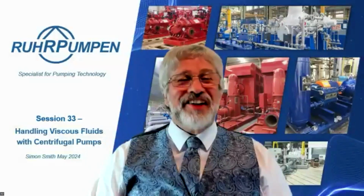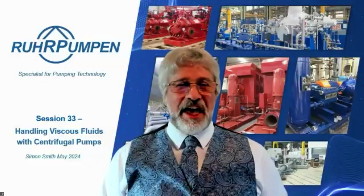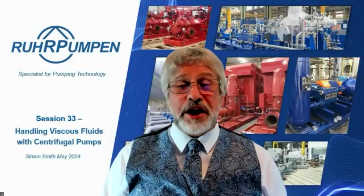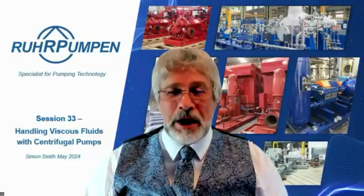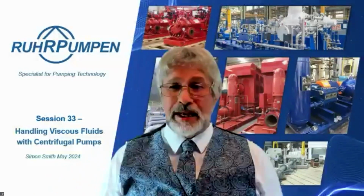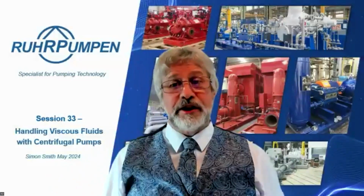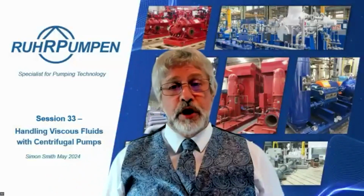Paul Berthiaume says, can you provide a brief history on how the parameter B was developed? No, I can't. I'm sorry, I wasn't on the panel of Hydraulic Institute that did it. I'll throw a question out there and see if anybody knows, but what it amounts to is the hundreds and thousands of pumps that are pumping viscous fluids. That data was fed back to the Hydraulic Institute, and they've tabulated it and looked at it and come up with both parameter B and the head and flow correction factors and efficiency correction factors. So it's a big task, and it's been improved over the years.